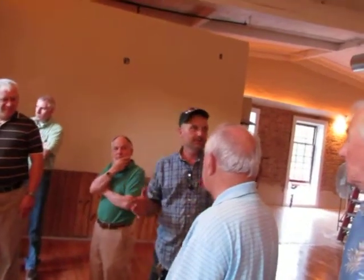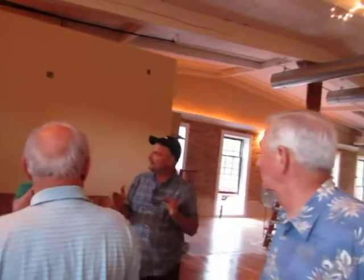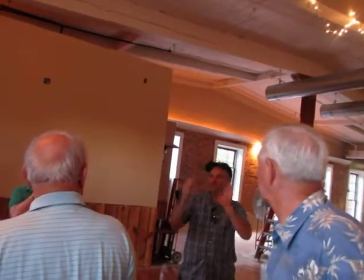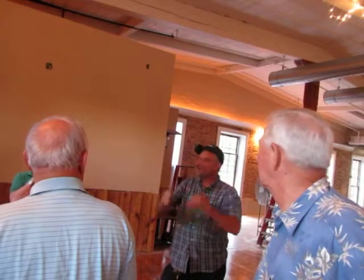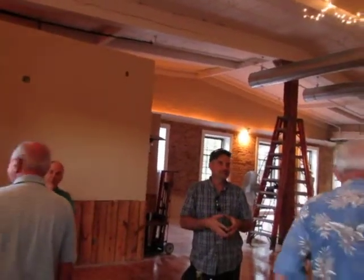And all the machinery here, of course, is off the same line shafts. So they had to time the machinery like a quarter second to a half second different. If you didn't, you'd set up a harmonic in here, and the whole building would shake apart. So you had to offset every machine in the whole building when the line shaft turned.